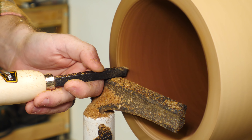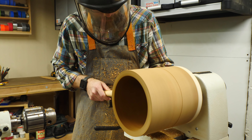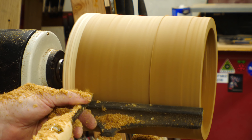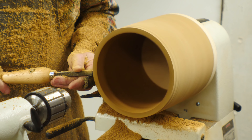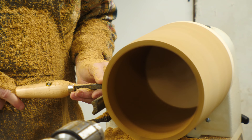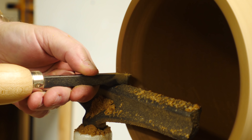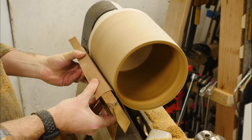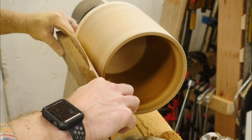The inside really just had to be a circle deep enough to be able to put in a bottom plate — I went in about three quarters of an inch. Then I went back and worked on the taper some more, trying to get the profile even and straight and the bottom to be thin but not too thin. One of the great suggestions from the comments about getting a flat outside shape on a turned piece is to put a piece of sandpaper on a block and use that against the outside to sand it flat. So simple, but it worked great.